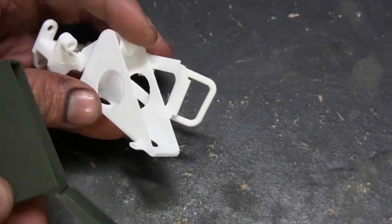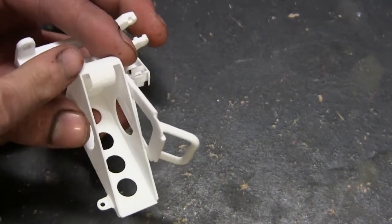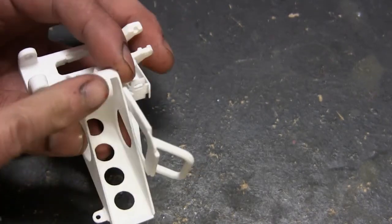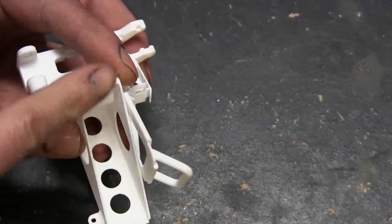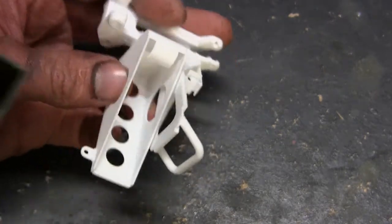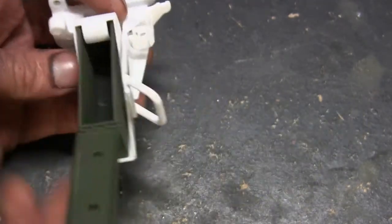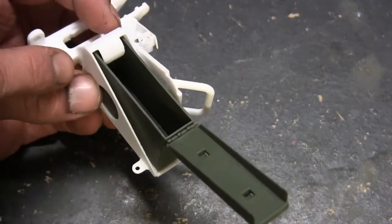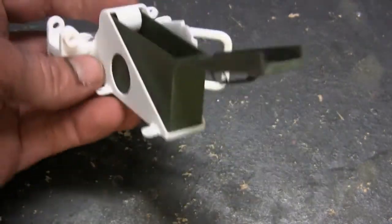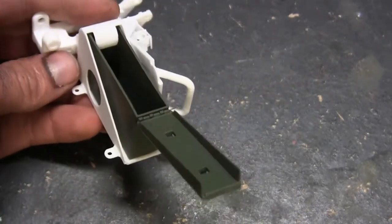But in the 1960s, on the M60 mounts, they came up with this really slick system that carried over to this unit here, where this little ramp actually serves two functions. It acts as a nice smooth area for the rounds to slide up into the MG. But with the way it's shaped, it secures the can in place by simply locking it like the way you see here. With the way the piece overhangs in, when the can fits in place, it holds it and prevents it from falling loose. No matter how much the unit is shook around, this thing isn't going anywhere.